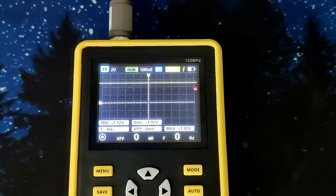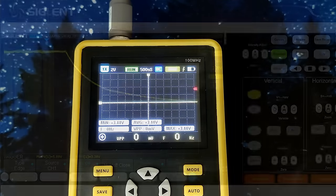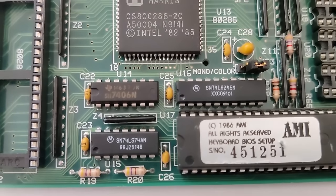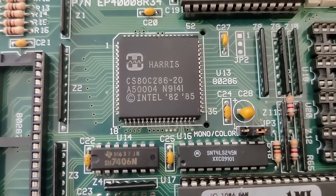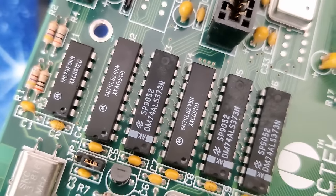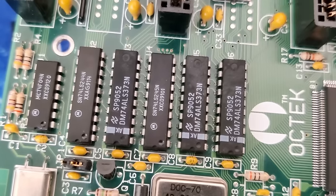One last thing I want to mention is that I have weird behavior on some of the address pins for the memory. Some of the lines mainly stay high. There are the occasional jumps down, but mainly they are high. This is very different from what Tony got on his 286 board when he removed all the memory modules, but that might be something that I have to investigate further. Tony suggested that I should check if there is maybe a buffer chip on this board that messes up the address bus. I don't know how to do that yet, but I am about to find out.